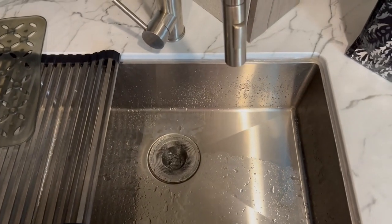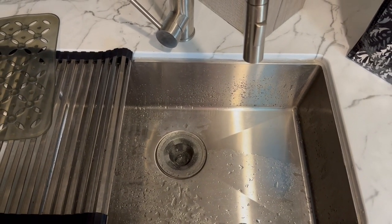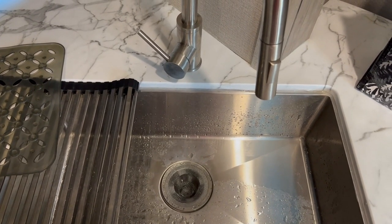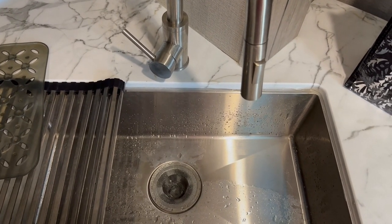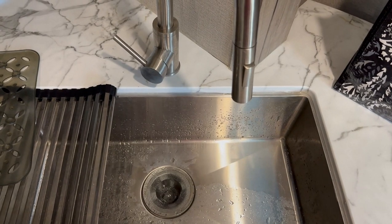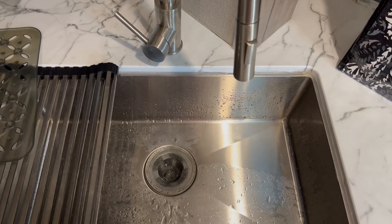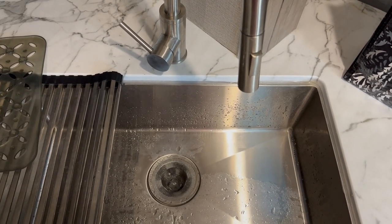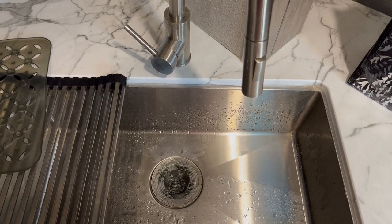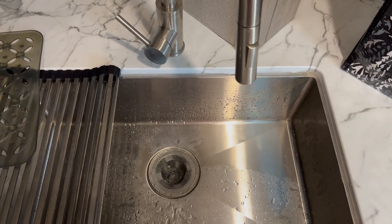The last big tip I want to give you: the campground I'm going to will allow me to use city water, so there's no need to turn on our pump. But what is important to remember is once we get our water in there, we want to turn on the hot at a couple different places — the kitchen and the bathroom at minimum, maybe even the shower — until all air is expelled from the lines. That hot tank is going to take a while to fill up and will push a lot of air out. If we don't do that and just connect our water line and turn on our electric hot water heater, we're going to find out we just made a very expensive mistake — it's going to burn out the element in that tank because it's not surrounded by water. So make sure you get all that air out of the system on the hot side, and once you've done that, you know it's safe to turn on that electric hot water heater.